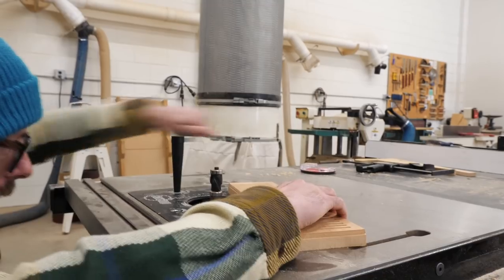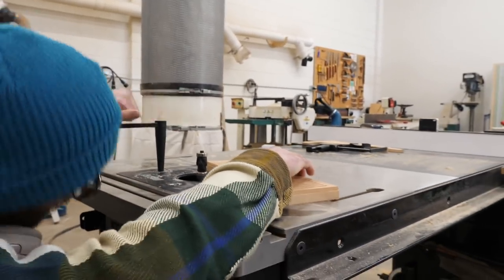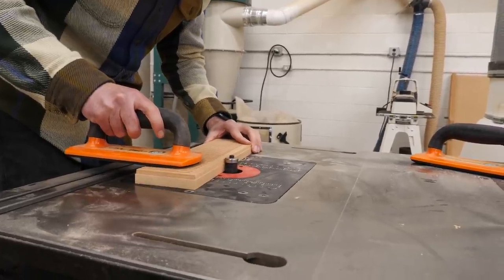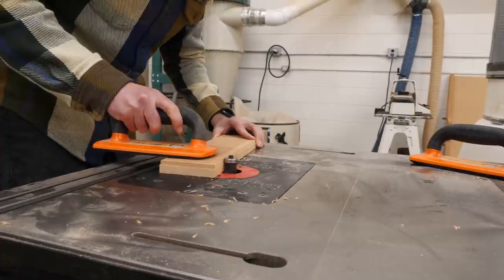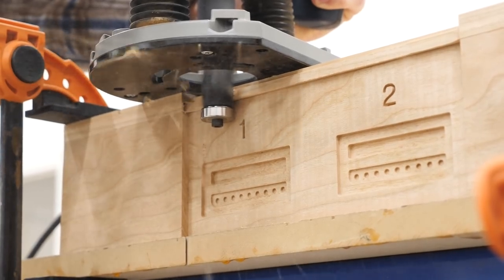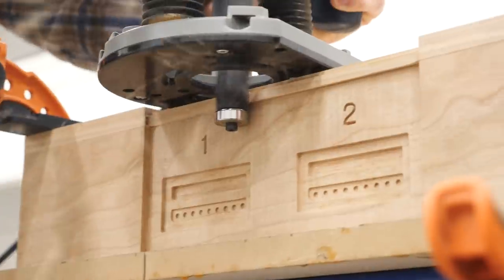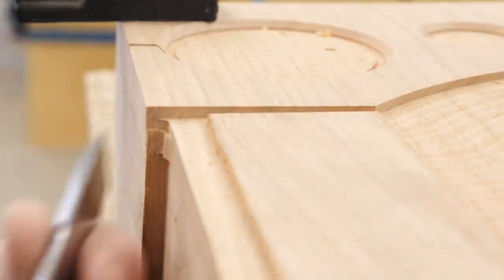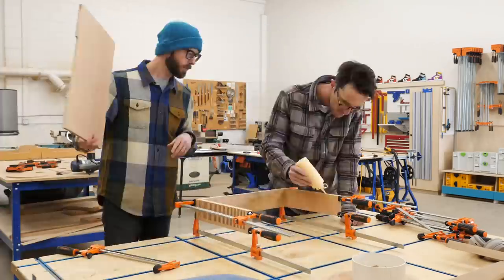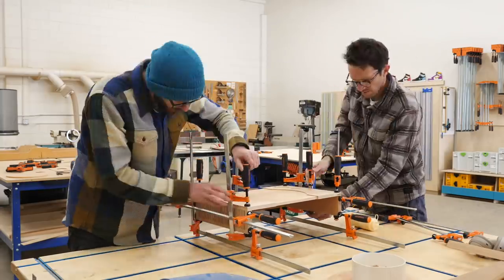Alright, so to make the pieces fit together nicely, we had to remove all the extra material left on the perimeter of the pieces, which we could do at our router table using a flush trim bit. That said, there were a few spots where there wasn't enough of a reference surface to do that — for example, on the top panel where the PlayStation's recessed in the middle. So to get a clean result there, we cut a little strip of hardwood, clamped the top and front together, and used the front panel as a reference surface so the depth of the recess would perfectly match across both pieces. Since the router leaves round inside corners, we squared it off with a chisel. Finally at this point, we could glue up the top, front, and two side panels, and then we had to wait for them to dry.